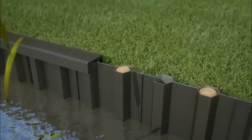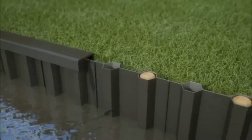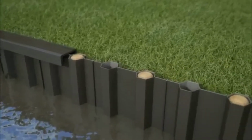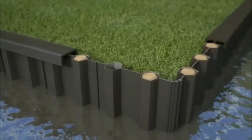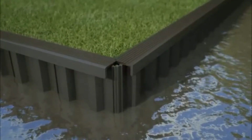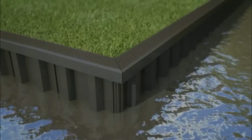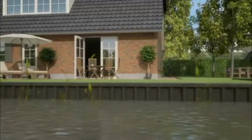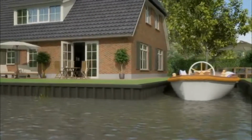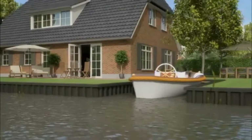In this design, you can drive 2 timbers per pile or 1 timber per pile. Obviously, 2 timbers is stronger. I have certain customers that will look to have timber in 1 pile, and then for a factor of safety or a confidence factor in future years, timber in the other pile can be put in later on, or steel if they're looking for more strength.